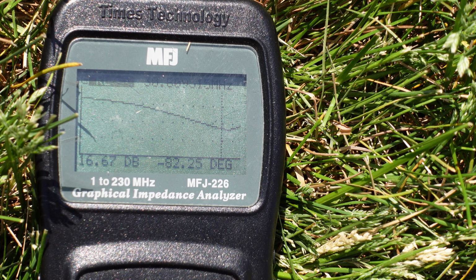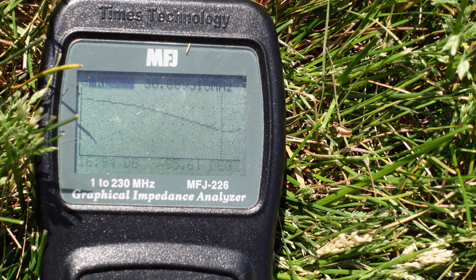From negative 85 up to negative 79. This shows an obvious, I know I'm probably peaking, this shows an obvious interaction with carbon fiber and a vertical antenna, or any kind of antenna that's semi-close to carbon fiber. But we're still going to continue the test. This was an afterthought after watching a video, which I'll also link below.